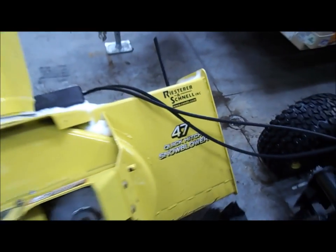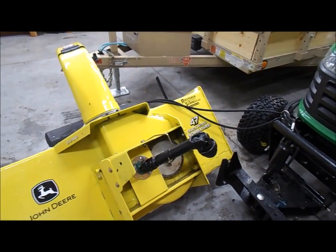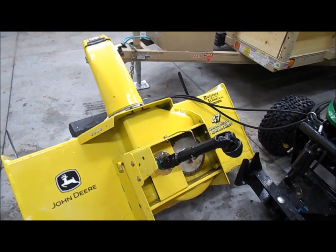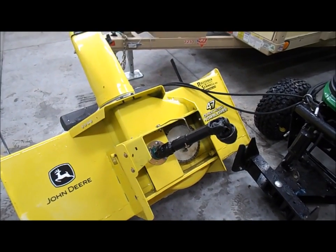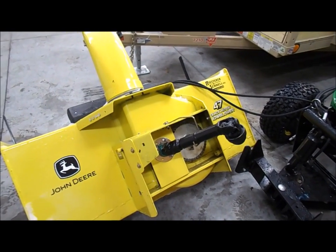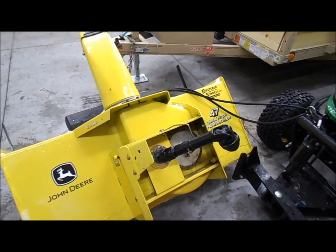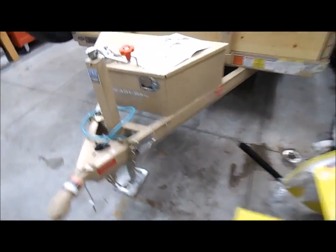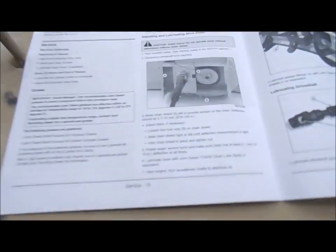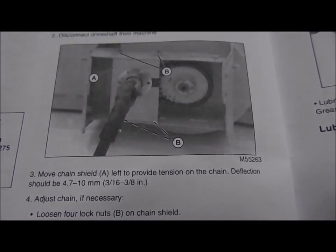We're doing a video here. I just got done blowing snow for the second time today and the blower seemed a little noisy. There can't be more than 25 hours on it — I've only had it one season. I thought maybe I sheared something off, but I knew it wasn't the drive shafts because I checked those. The book says you're supposed to adjust the chain. There's a chain in here with a sprocket — looks like a number 50 chain, pretty heavy.